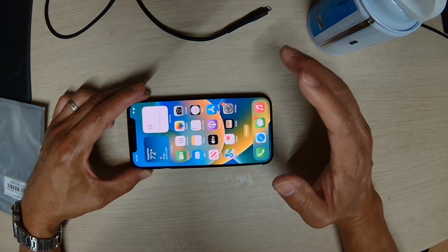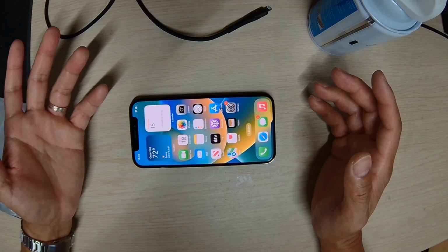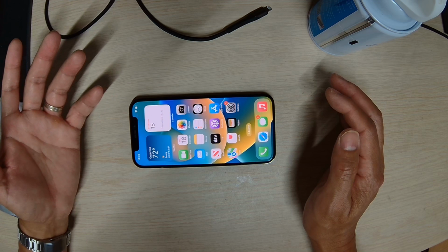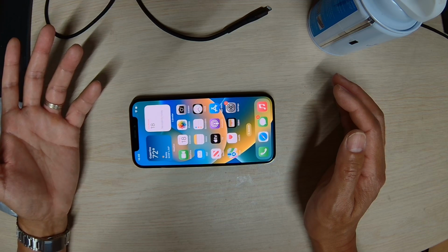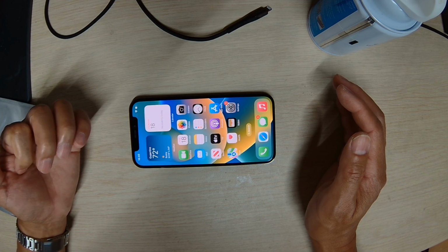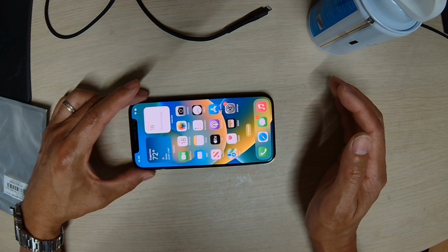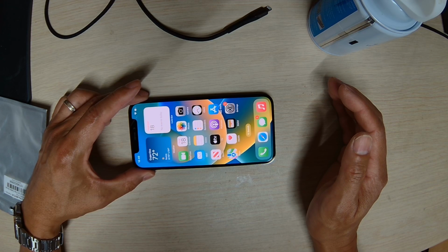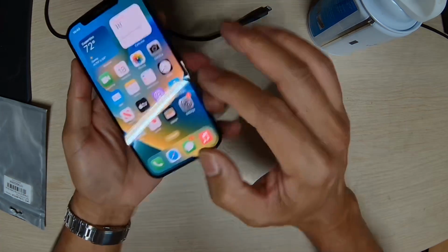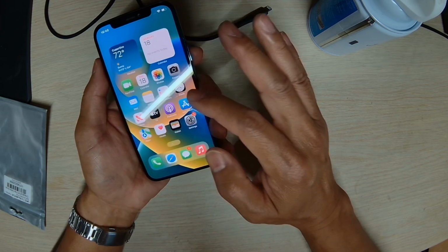So what happened is, when your phone got dropped and the board separated, and you try to fix it by updating the software, the update could not read the baseband CPU. So that's why even though the software update has gone through, you cannot make a call or see the IMEI number. So we rebonded the board and then updated the software. We were able to connect the software with the server, and the service is back on again.